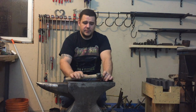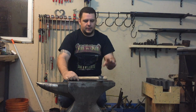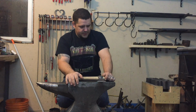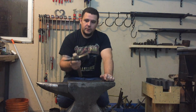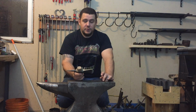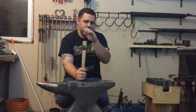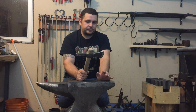So there's a number of issues with this build as it stands. It's complete, sort of, at the moment, as far as the video process goes. A couple of issues you noticed with the video. The major one was during the heat treating. I initially tried doing it in oil twice and it just was not hardening. The file was biting, it wasn't getting where I wanted it to be, so I took a gamble, I took a risk.